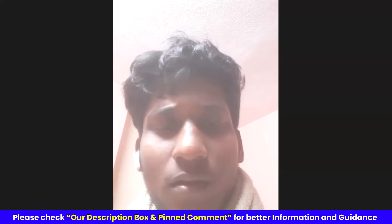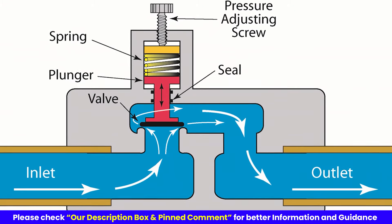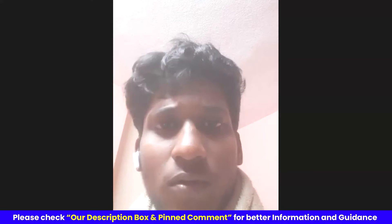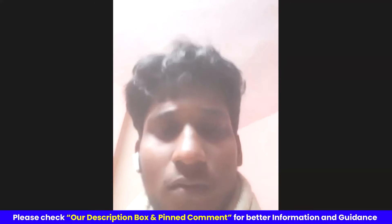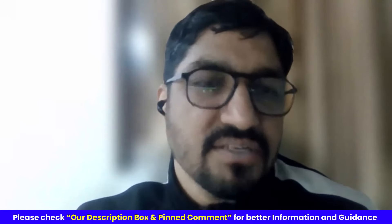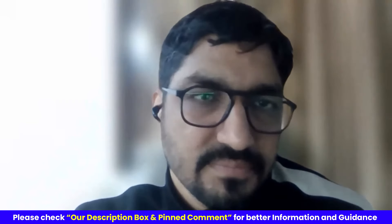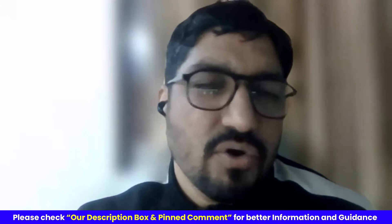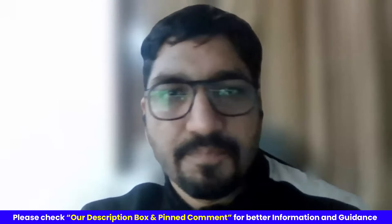Is the back pressure valve a non-return valve? Yes, it is a non-return valve, because you can't get your gas back from the meat and fish room back to the vegetable room. Do we have any non-return valve in the fish room and meat room also? No, you do not have one there. There is no need, because there is no way that gas can go from one room to another room. The compressor is the boss — the suction side pressure is always less than the pressure in the three rooms, so the gas will always move to the low pressure area, which is toward the compressor. The flow will always go to the compressor; continuous flow is a must.